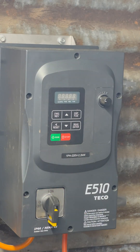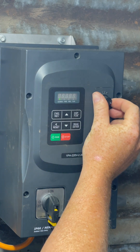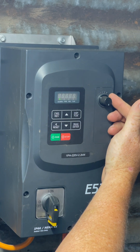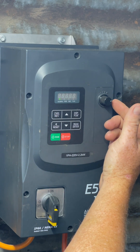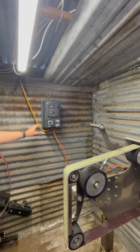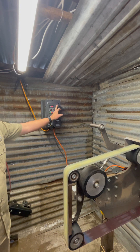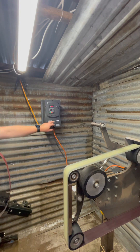Once you've done this, it's time to test it out. I tested mine without engaging the grinder, just using the potentiometer itself to make sure that the display referenced the correct numbers from 0 to 75 and that those were steady. Once confident with that result, I engaged the grinder from 0 to 75 and back down again to ensure the new potentiometer is working as it should. By this point your grinder should be working perfectly. If you're still having issues or have any questions, please reach out to Gamaco Artisan Supply's customer service team and they will do their best to help you through the process.